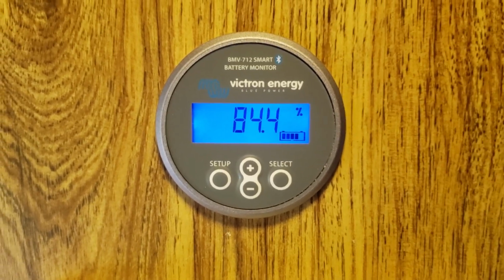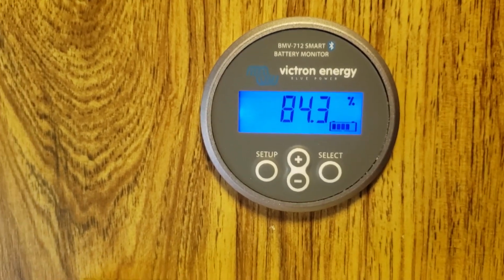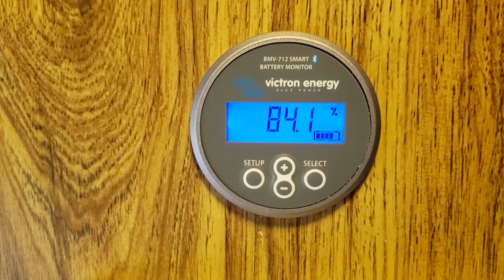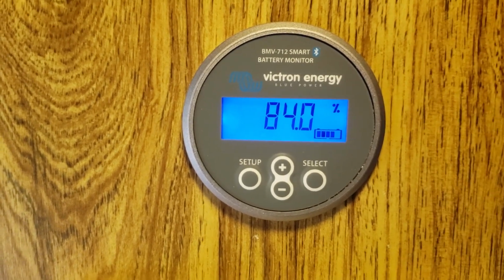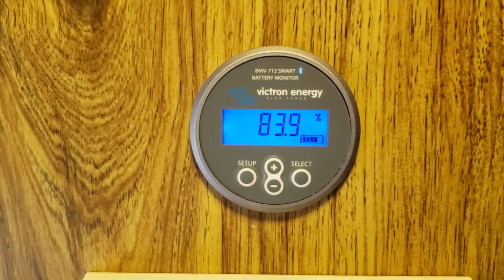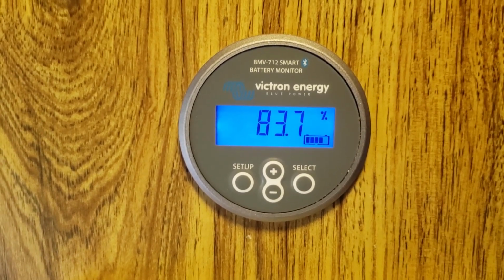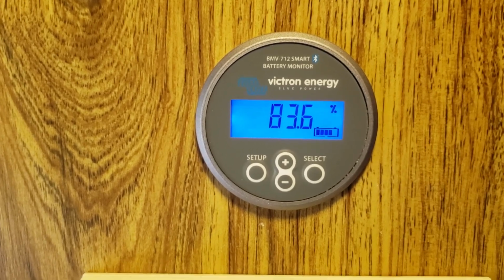Big 15,000 BTU air conditioners actually drain my battery slower because they have cycles. This is just going to be on all the time, and that resistance load is just like connecting two electrical wires together, and that makes heat. It's really hard on anything, so I would never recommend that you use it for that kind of thing long term. Even coffee pots, anything that makes heat with coils is just connecting the two circuits together, making it nice and hot, and they use a ton of power.